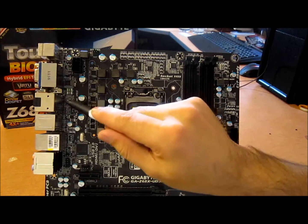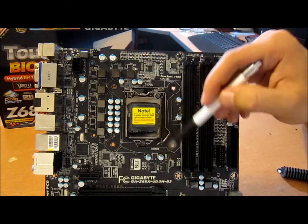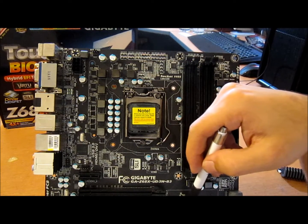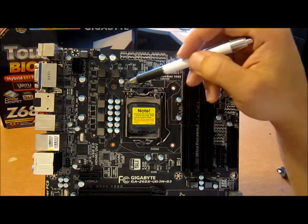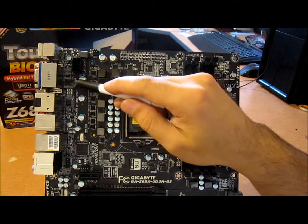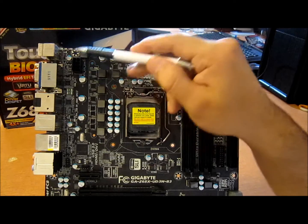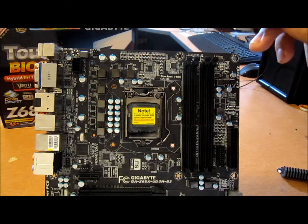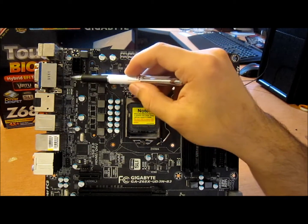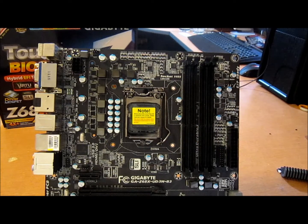Okay, these are PCIe level shifters, digital video to HDMI/DVI output. Basically, the video is funneled through the DMI from the CPU IGP to the PCH, and the PCH has video outputs. Alright. They don't come directly from the CPU. And basically it comes out as one analog for D-sub as well as digital outputs. And the thing is here, the digital output really can only be directly hooked up to DisplayPort. So basically these level shifters allow it to change into HDMI as well as DVI.